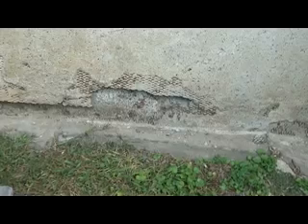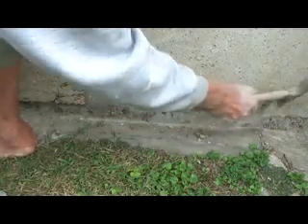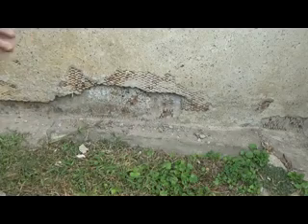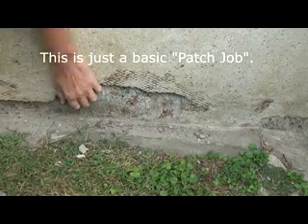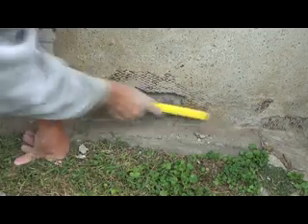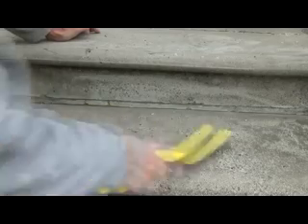The whole thing I'm going to do today is just patch it up. The whole thing is loose because of the wire mesh. Just get all the loose stuff off. See where it's bad — the whole thing's moving. I ain't ripping the whole thing off. I'm just going to patch up underneath it, and some day when it's bad again we'll fix it properly. Just wire brush it off. Now we're looking at the steps — we've got these cracks and pop marks, that means it's falling apart. We're going to use the wire brush first, get all the stuff off.